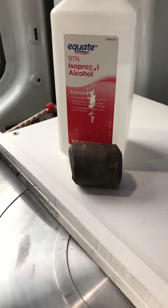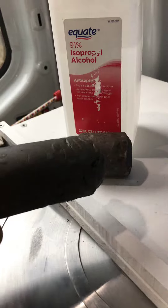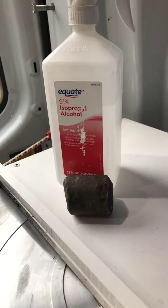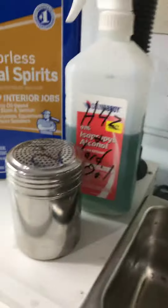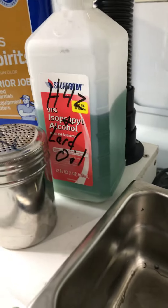If I'm going to use a cliplap stick, whether it be homemade or factory, it doesn't matter. If it does not have an oil base, I clean with alcohol. I do not use alcohol if I'm going to charge with H42 and lard oil, which is my preferred mixture.